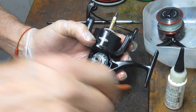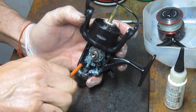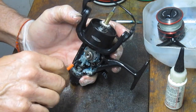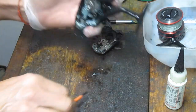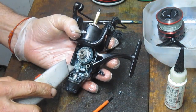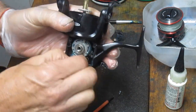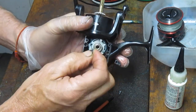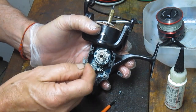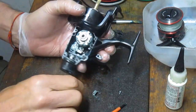There's a small clip here again. It looks like it's going to be the micro screwdriver again. That's going to be the clip that's holding on the axle shaft. So take that off. Again, very small screw, and then this should pry up like that. And then you can pull it out like that. Now notice the orientation on this. These are the easy things. They're almost throwaways, right? You just are in a rush and you figure this one's easy, and you don't remember if it goes this way or that way. This hooks from underneath, so just pay attention to that as you go to do that.